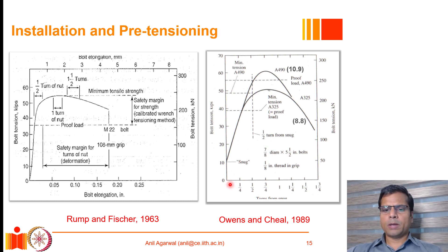The same behavior can be plotted using the turn of the nut on the horizontal axis. Bolt elongation and turn of the nut are not necessarily linearly proportional. Counting starts from the snug tightened level, where bolts carry only a very small tension force. As the nut is tightened further, tension force increases initially linearly then non-linearly. For both 8.8 grade and 10.9 grade bolts, approximately half a turn beyond the snug tightened level is sufficient to develop the proof stress level.